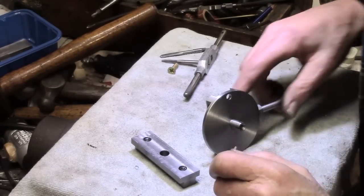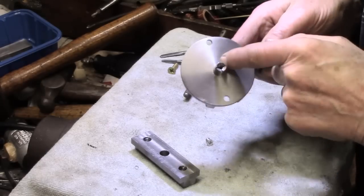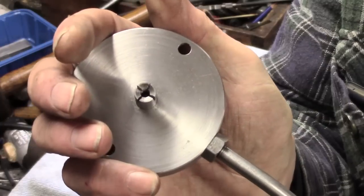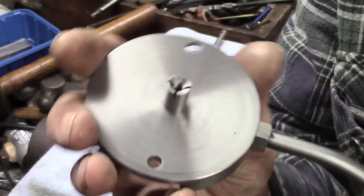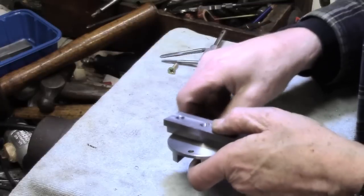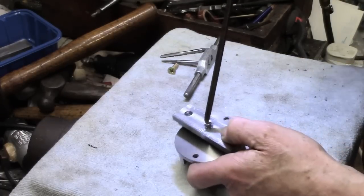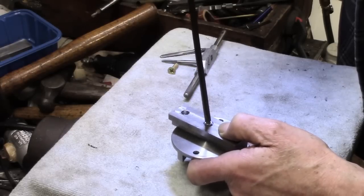Here's what I've done: I took the handle off but worked on this all together because it was press-fitted in. I used a very thin slitting saw to begin with but it was so dull I switched to a bigger one — about 32 or something, a bit bigger than I needed — and I've gone a little bit deeper than on the first cut. I've put the countersunk screw in, which I turned down on the outside a bit. It's all a bit of a squeeze, to be honest, but I think it's better than it was.